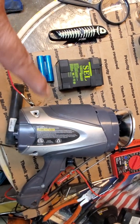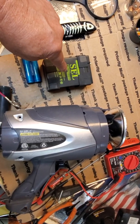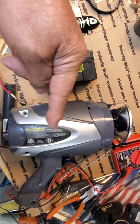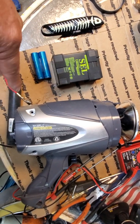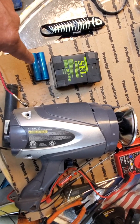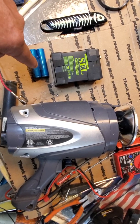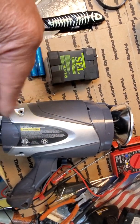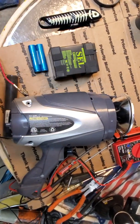It takes a sealed lead acid battery, and this one's no good. I pulled it out already — as you can see I already had the flashlight taken apart and my wires connected — to show you how it lights up with lithium batteries. I'm going to be using four of them: two sets of a pair connected in parallel, and then those pairs in series, so I can get my six volts, which will be almost eight on this thing.